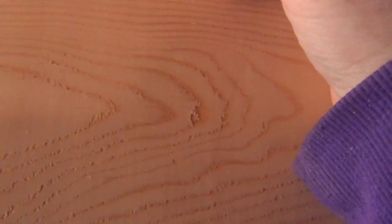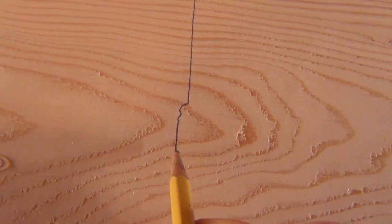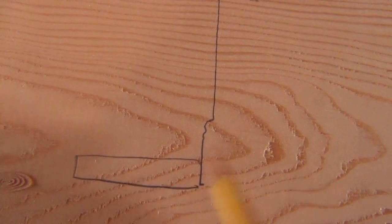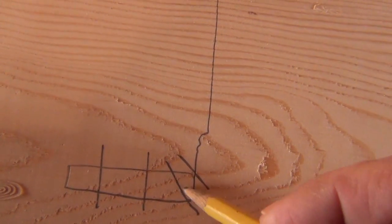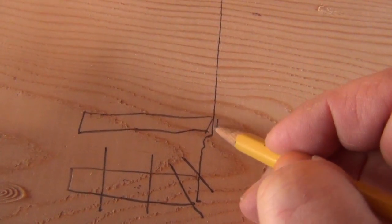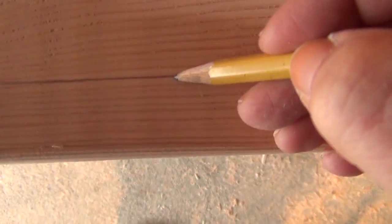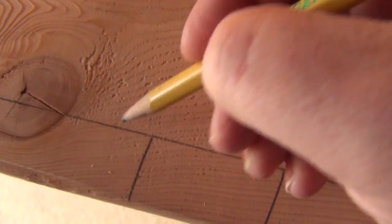All right, so now let me show you a quick drawing on it. And again, it's at the bottom, so I don't care. If this is my wall, right, I have a baseboard right here on the wall, and that plate that I just created is going to go right here, and it's going to be anchored in the baseboard and directly into the floor. However, that plate needs to be shorter than the one that goes on top. Why? Because it's against the baseboard, and that's about an inch. So what I got to do right now is mark an inch off right here on the edges of my 69 inch board, and I'm gonna do something that's called ripping the board, where I'm gonna just take off an entire inch throughout the entire length of the board. Am I making sense? I hope I am.